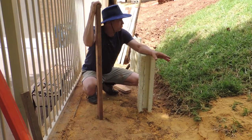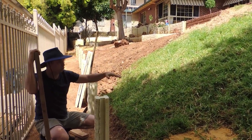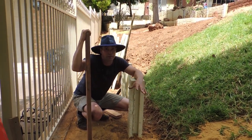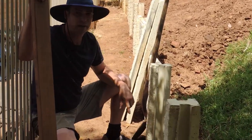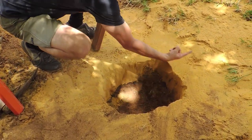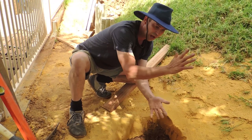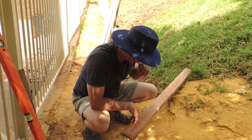This particular soil, once it dries it sticks like glue, so it's not a problem. As you can see by this slope, this wall is only going to be retaining a small section — there's no house foundation or anything, just small plants going here. So we're actually going to cheat today and only put in 900mm posts because there's solid granite rock under there. Another way to cheat: when you put the post in, make the footing further towards the back, which creates an anchor — the weight of the soil actually keeps the wall up. But the right way is double the depth.